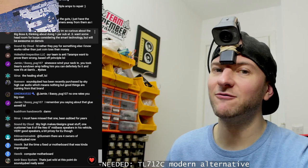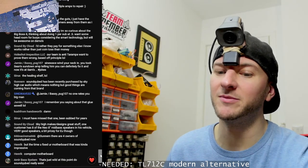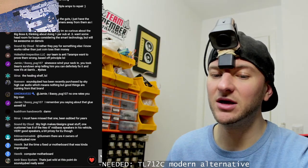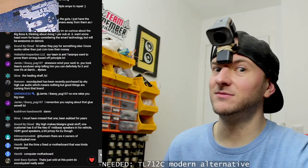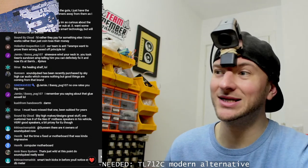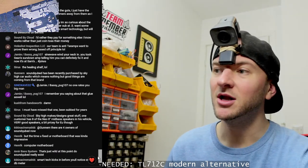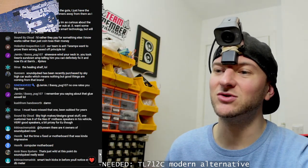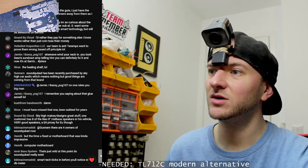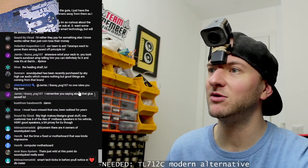So the Big Boss 8 is great if you are absolutely sure that you never want to clamp more than 8K from the amplifier. In some cases you actually do, if you're running really, really big stuff, especially for burps and competition use. The thing with the Big Boss 8 and the Smart 8 is they don't really allow you to clip. And when you're in the lanes and you're burping, you actually do want to be in clip. Like, you do. It's louder. The subwoofer overshoots and completes the rest of the sine wave that got clipped off a little bit just because it has momentum. So you do get louder from being in clip at the competition, in the lanes. If you're playing clean in the lanes, then you're just sandbagging and it's kind of pointless. They're not great for competition use, but they're great for daily and for demoing, provided you don't want to clamp over 8K.